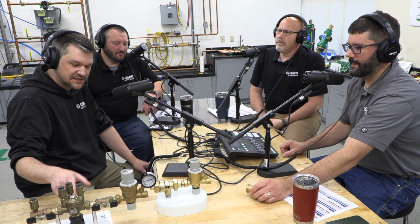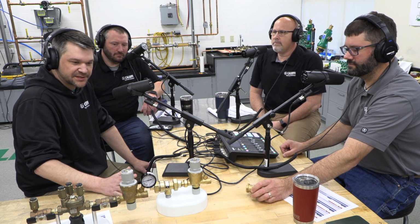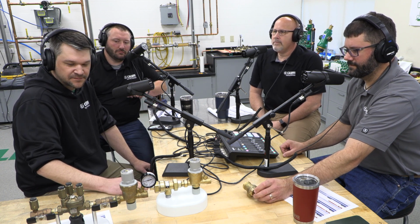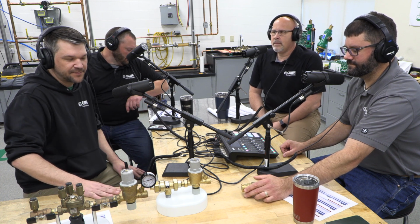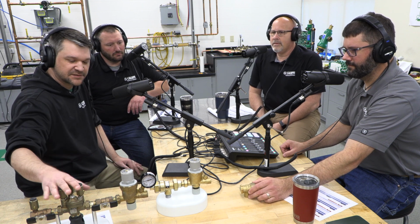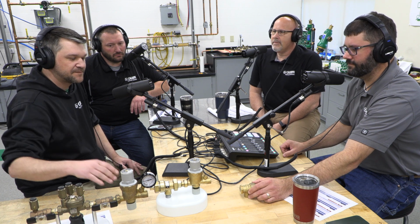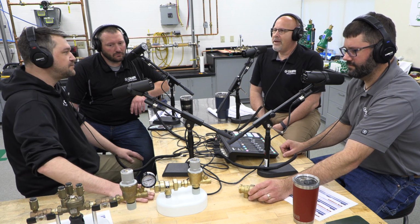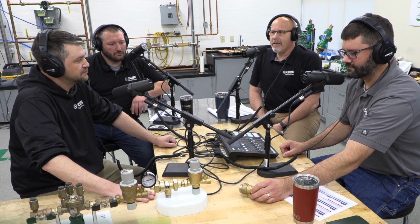But this is the most foolproof, highest hazard protection that you can get out of any backflow preventer. We'll get deeper into backflow preventers on another episode coming up, but there's certain applications where you absolutely cannot use anything less than an RP. Sure. Check your municipality, check your local codes. A lot of commercial projects will require that RP.